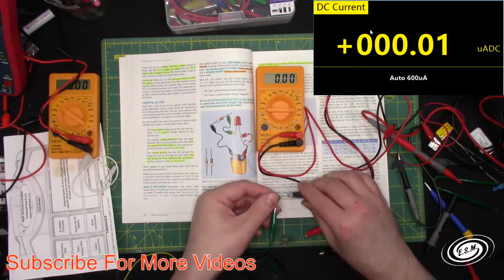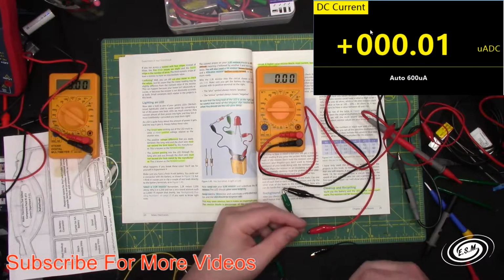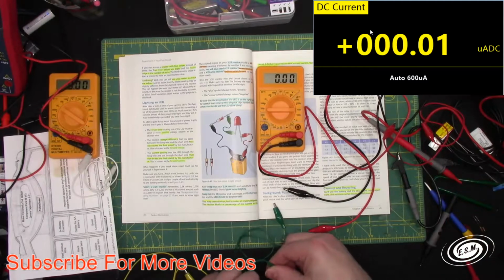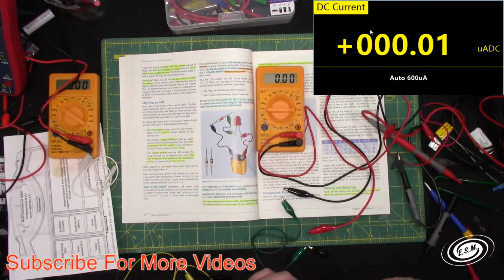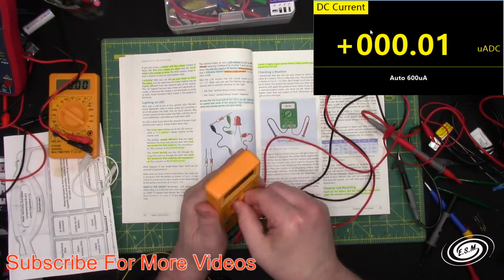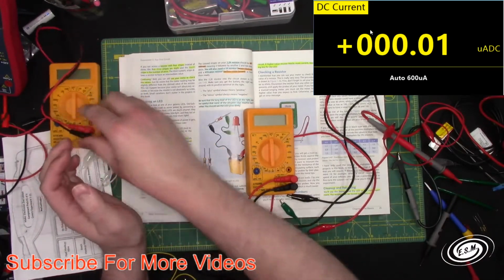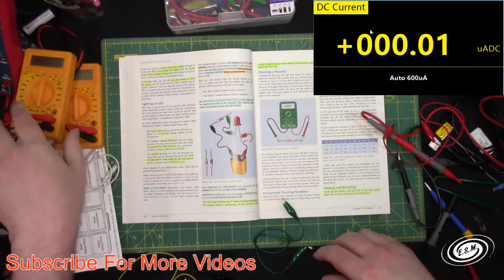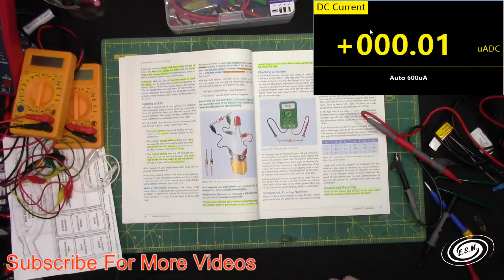You could see how the resistors limited the current through the LED. And right there we learned properties of a resistor. We learned what a forward voltage of a diode is. And we learned how to hook up multiple meters to measure things and get a mess of cords everywhere on your bench that is going to take hours to organize and put away.